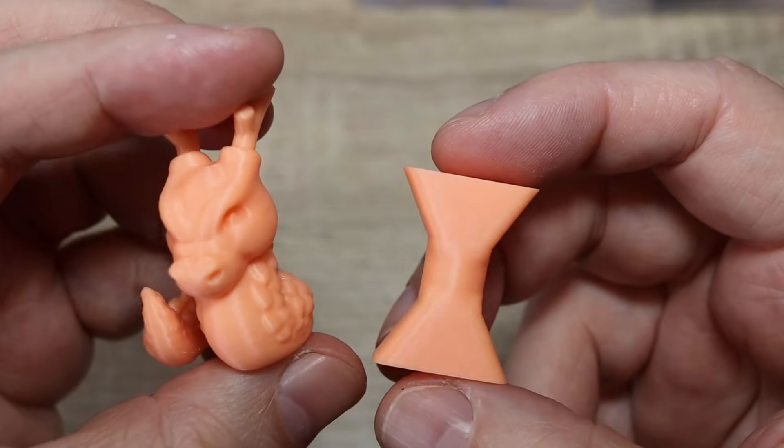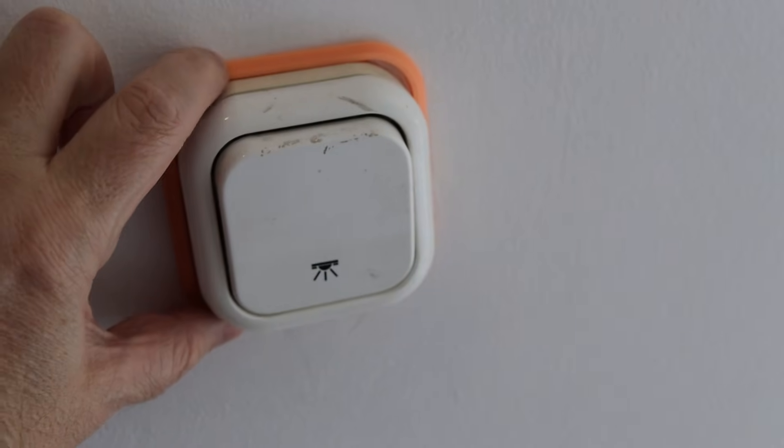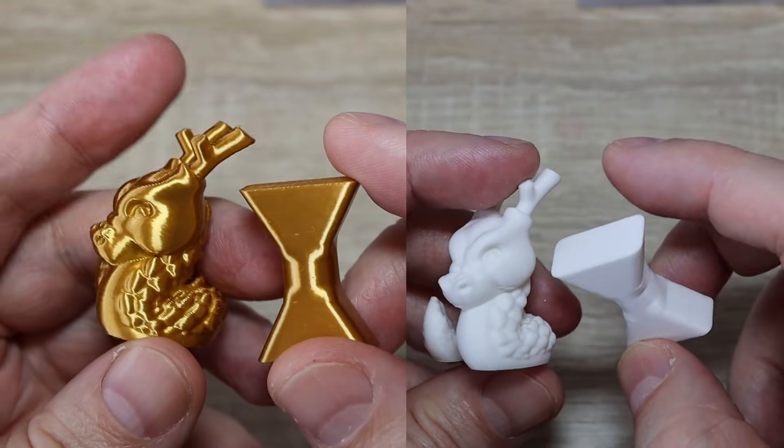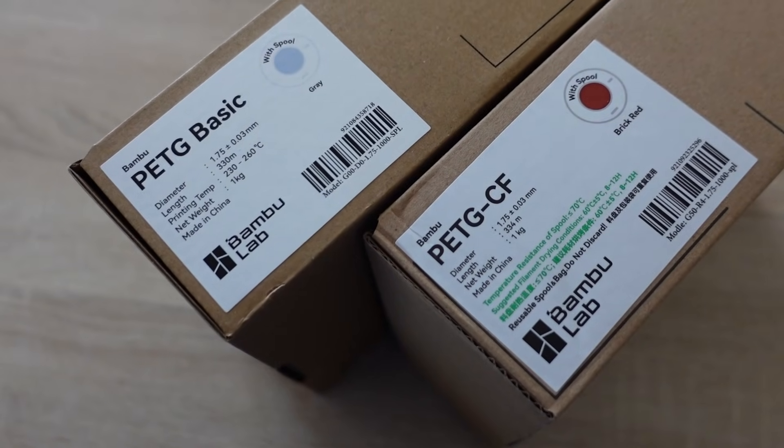About PLA Glow — I have experience with glow-in-the-dark filaments, usually in green, and I know this orange version doesn't glow as well as others. I'm not sure if it's the color or the filament type. If Bambu Lab wants to send me all glow colors, I can do a comparison to see which glows best. For other filaments, if you need mechanical parts, try to avoid silk and matte filaments. In future videos I want to do a detailed comparison test with PLA Basics and the carbon fiber version, and after that a PETG regular versus carbon fiber comparison. Thank you for watching and happy printing!